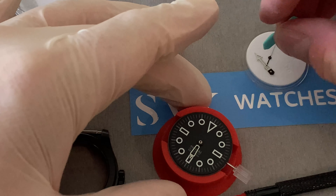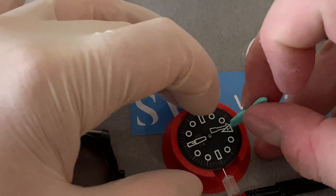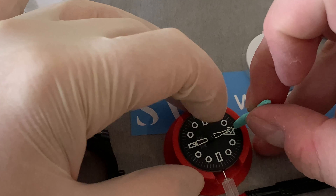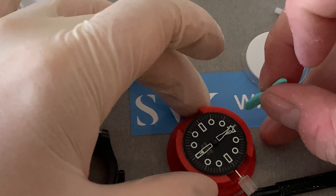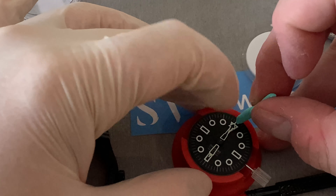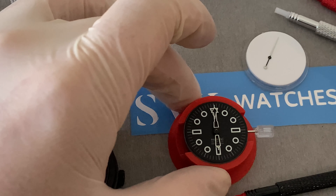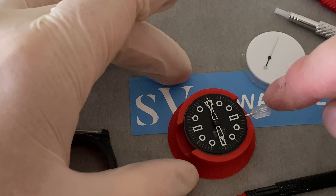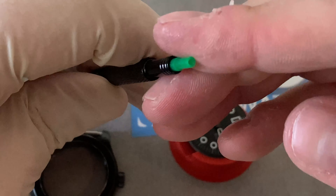Setting hands can be a bit scary, but over the years I found it much easier to do it with these kind of tools. In the past people actually used Bic biros - take the pen ink bit out and just use the end of a pen lid or something like that. But these are actually a really nice addition - you don't usually get these things inside a watch kit that you might find on Amazon. Also a case back removal tool - this is a compact small one. You just turn it and set it to different sizes and rotate it.